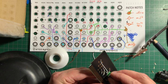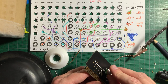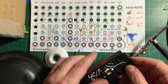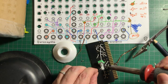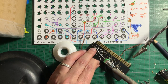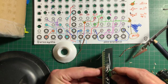This output to the ground right there, to that right there, like that. I'll have to use a resistor leg or something to extend it. Start by soldering the ground right here. I'm gonna do this from the top so it doesn't fall off. Good thing these are nice chunky pads. I can use a good amount of solder to make it structural. And I'll probably use some hot glue afterwards just to make sure it stays.